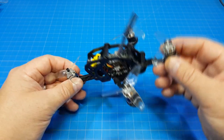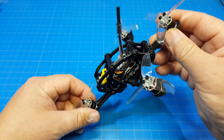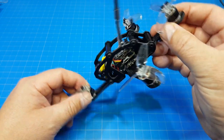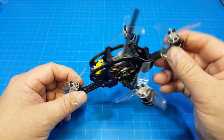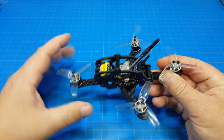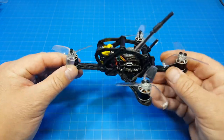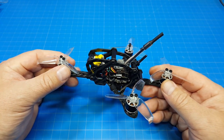And that's because they're working hard to create that forward angle. And then when we yaw around, when you're flying, if you get enough angle, you're using more roll than you are yaw, but when you're down, you're using a little bit more yaw than you are roll. So depending upon how you fly, the stress on those motors in a typical configuration may change. But in this configuration, we have 3 motors technically working together to create that yaw action. So that feels slightly different, but it didn't feel so different that it felt foreign to me.